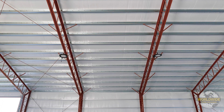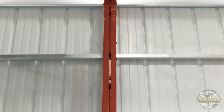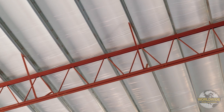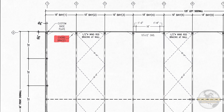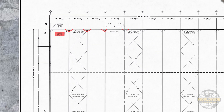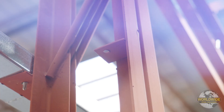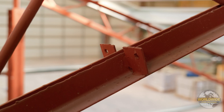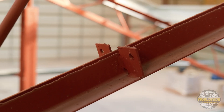The Worldwide Steel Buildings web truss framing system requires cord braces to brace the inside flange of your columns and roof trusses. The locations required will be shown as dashed lines on your W drawings. Your columns and roof trusses will have small tabs welded onto the inside flange at each cord brace location, as shown here.